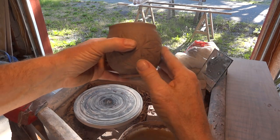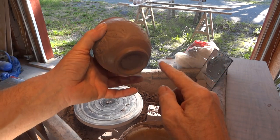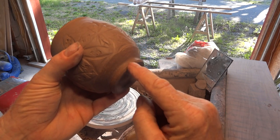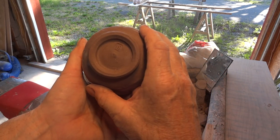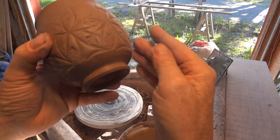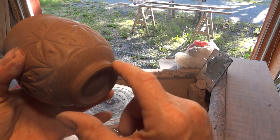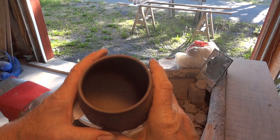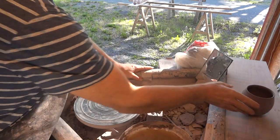The narrower you have the foot, it gives it more elegance, but they get to a point where it gets too much and then it doesn't look right. Another thing to notice is there is a bevel on the edge of the trimmed foot — never leave a sharp edge. It doesn't look nice, it's not user-friendly on furniture tops, and it's more easily prone to chipping. If you take the edge off and put a chamfer, a bevel on the corner, it will make it stronger. A broken corner is always stronger than a sharp corner.